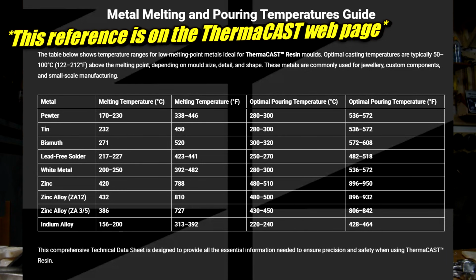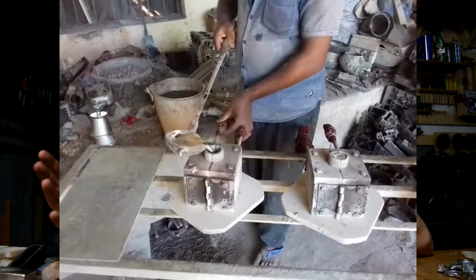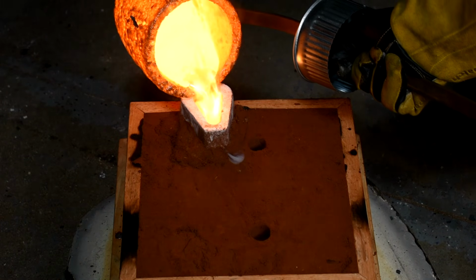But 1,000 Fahrenheit, 550 Celsius, means you can do functional tough metals with it, like zinc alloys, like Zamak or ZA12, my favorite alloy of late. Sure, you can't do aluminum like other die casting, and you can't do bronze like the other kinds of casting, but Zamak alloys are not just decorative like pewter. They don't look as good as pewter, that's one, but they're very tough.